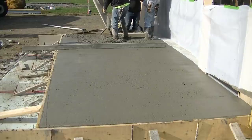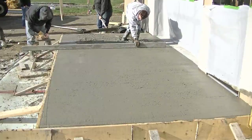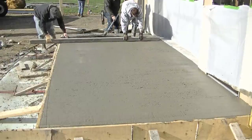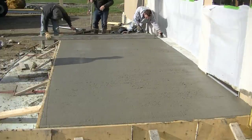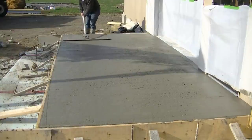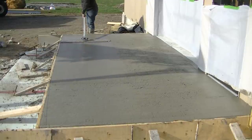Once we get down towards the end, we'll put a little more concrete in there — we don't want to put too much in and have to shovel a bunch out. There aren't really too many tools required to pour a slab like this. You can see we got a screed, a concrete rake or come-along, Darren's got a mag float, and then we'll have a bull float. All those tools are down in the description below. There isn't too many tools required just to get the slab poured. The bull float is just going to smooth out the surface, push some of that aggregate down a little bit, and bring up some of the paste.